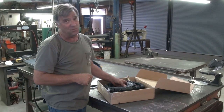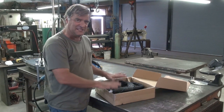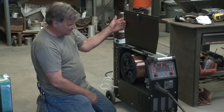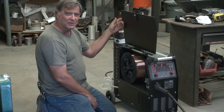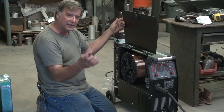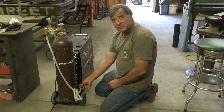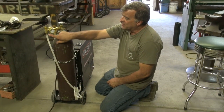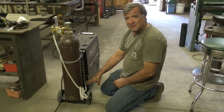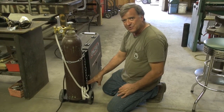That does not come with it — that's an option, just like the spool gun is an option. It's pretty much your standard setup inside. It's got a nice metal drive roller assembly with steel wheels instead of plastic ones. It's geared instead of keyed. And on the back, this one has a barb for the hose — when you put the hose on you just put a hose clamp on it, same with the regulator. This is a pre-production machine, so this should have been changed in the production machines — it should just have a regular hose fitting on it.